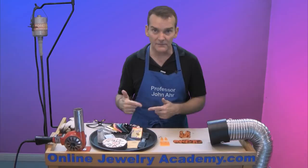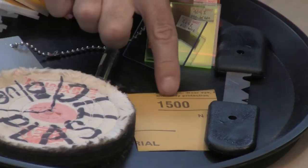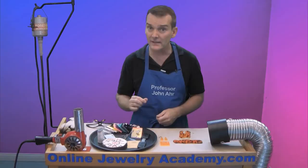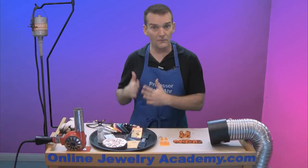To prep the plastic for polishing, it needs to be sanded to a very fine finish. You need a 1500 grit — that's a very, very fine sandpaper. It's kind of difficult to find sometimes. Your local hardware store might not have something quite that fine, but if you go to the automotive store, you'll probably find it there.